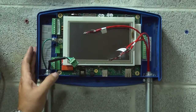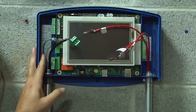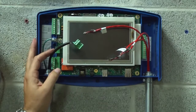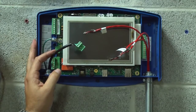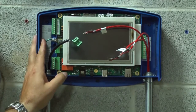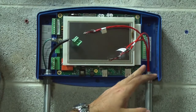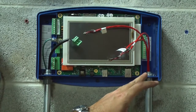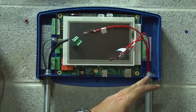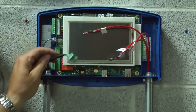When wiring up the Nano console, you'll see that I've installed an IS ground. You really need to run a separate earth ground and an IS ground back to a bonded neutral back to the electrical panel. The reason is that you need a grounding source so that if something is shorted in the field, you will not send any high voltage down a probe or sensor wire due to the intrinsic safe value of the barrier.